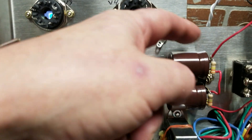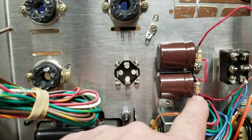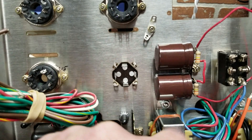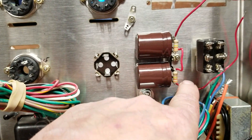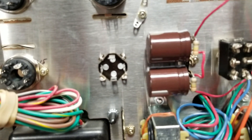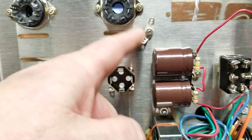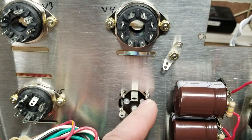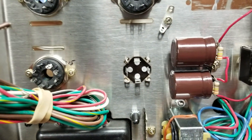For the supplemental cap module, the negatives go on pin two and pin five. It's a resistor between pins one and two, a resistor between pins three and four, a jumper wire between two and four, a short wire on five, and a longer wire on one. Make sure polarity is correct - you can see the stripe on the caps. Pins two and five are the negatives.